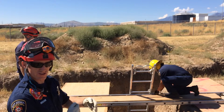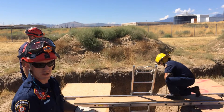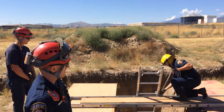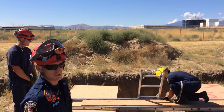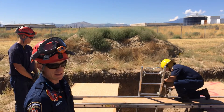If your trench is narrow, you can also do the same technique using just multiple 2x12s that you secure down by nailing to the ground pads, and build a little bit bigger platform. If your trench is very wide like this, it becomes a little bit of a concern where, if you're just using 2x12s, they bend and give a little bit.